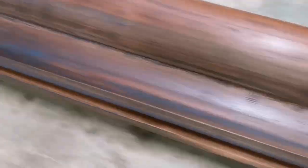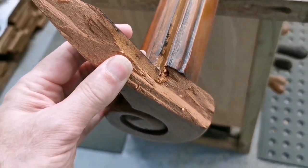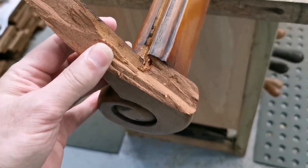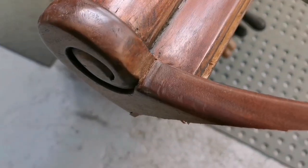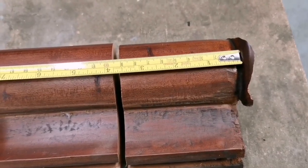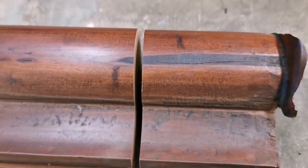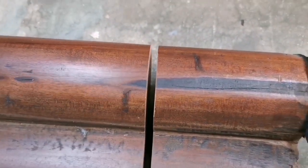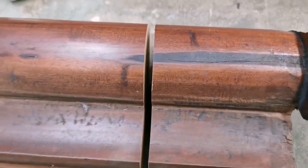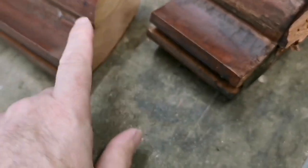So that's done. At the same time I was doing that, this end fell off - I was told it had spent some time outside in the rain. They wanted 100mm off, but I've taken 95mm off. You always want a few millimetres of play to tuck the sheets in. A couple of mil will be fine - with two and a half mil either side. So that end's chopped.